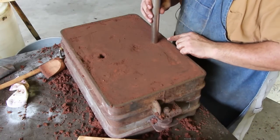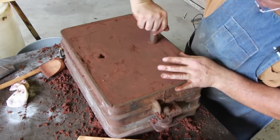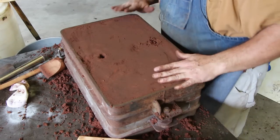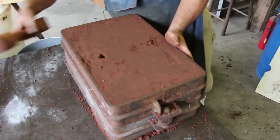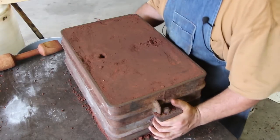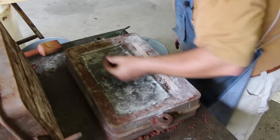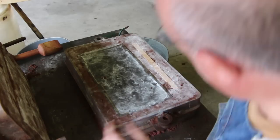And we'll cut our pour hole here — our gate for pouring in there. It goes down to the gate we got below and I'll just go down until I hit that and it will come out when we pull it out. Alright, so I think we're ready to separate the mold now. Let me clean up my table here. Wrap everything here real good to just help break it loose. Get ready for separating and carefully lift the top mold off here.